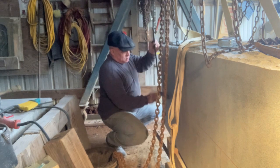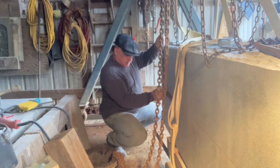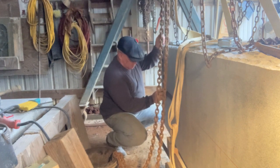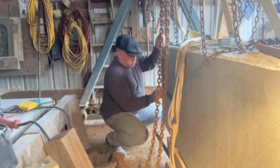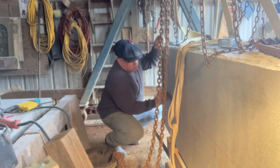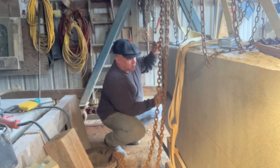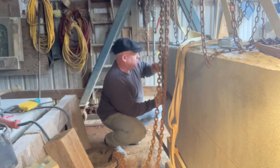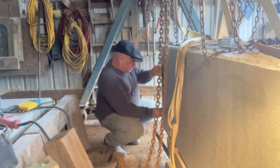Then because I've got this straight edge, this center line, I can put my square on that line. Get the interior marked right, match it up. And then I can mark my line. And then you can drop this in order to carry the line to the bottom.